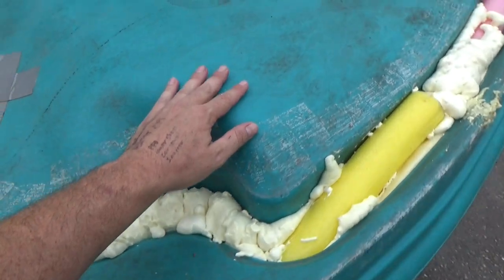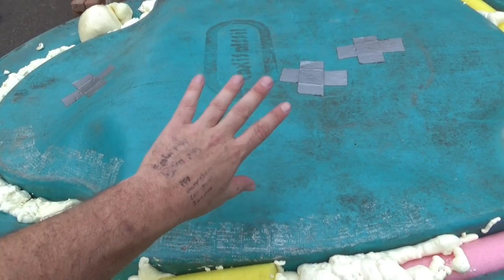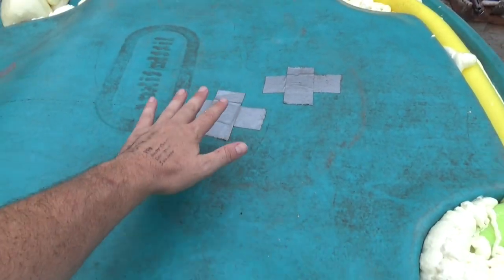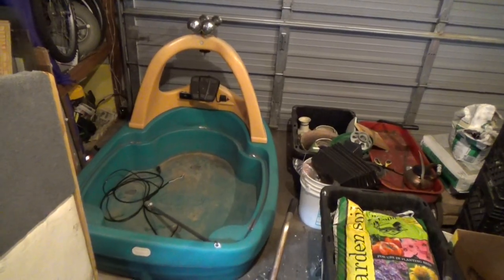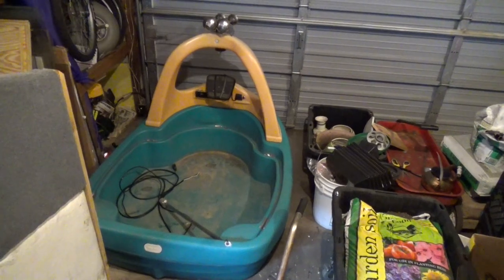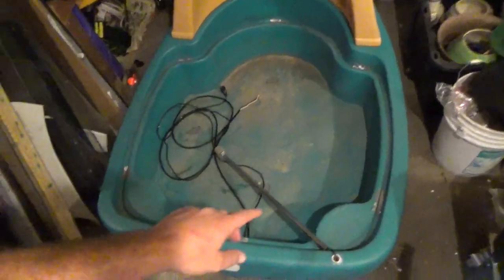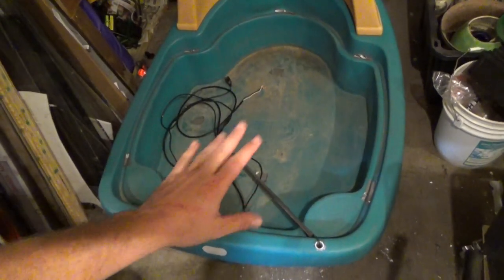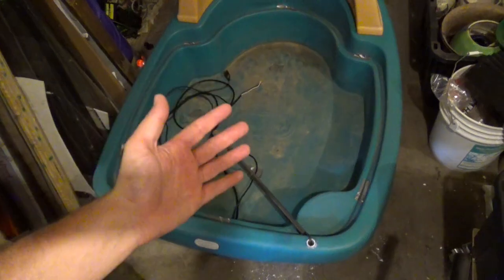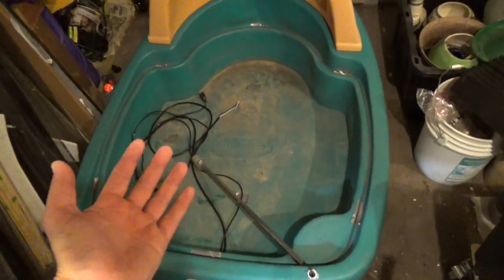So I need to make this hull a little more rigid. It's just sitting on those milk crates now, so it's all bowed up. This bottom is just really floppy, so I want to make this more rigid, maybe add a little more flotation. It's another day, and we've moved into the garage because it's actually raining outside for the first time in weeks. So today I think I'm going to try and reinforce the bottom of the hull on Tuggy. I'm going to flip it over, put a layer of foam board down for extra flotation, and then under that we're probably going to put a big piece of plastic — I've got all this plexiglass and plastic sheets and whatnot, so I'll probably put that on the very bottom to protect the foam board.